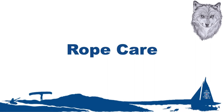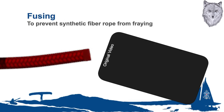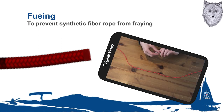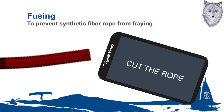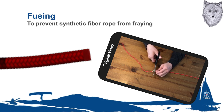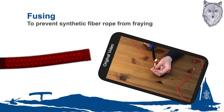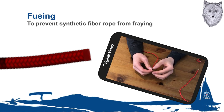Taking care of your rope is very important, namely making sure that the ends do not fray and come undone. There are two ways to deal with this. Common whipping involves using yarn or a thin cord to hold the end of the rope together. Synthetic rope ends can be sealed by melting with a special heat tool or by melting over a flame to fuse the fibers. Tape wound around the ends can provide a temporary whip. Cut the rope in the center of the tape, light and let burn for approximately 5 seconds or until the end starts to bubble. Let cool, then remove the temporary whip.